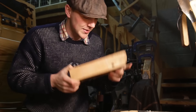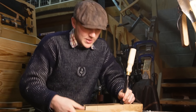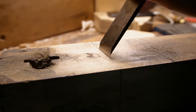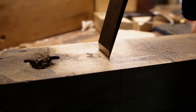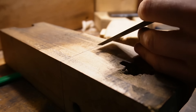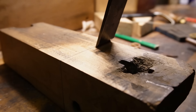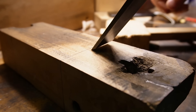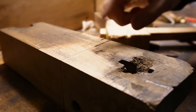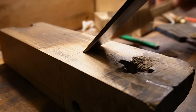So I have it all marked out there now with the pencil. Now I'm going to come along with this chisel here and just mark out the line properly. I'm just making sure the bevel of the chisel is facing away from the actual mallet here and I'm just striking down like that, doing that the whole way along the cut. Then I'm going to turn it around and this time face the bevel towards the cut we just made and give it a strike. That should allow us to peel a groove the whole way along our line, and eventually when we bring a saw to that line, this groove will help the saw slide along exactly where we want it to go.